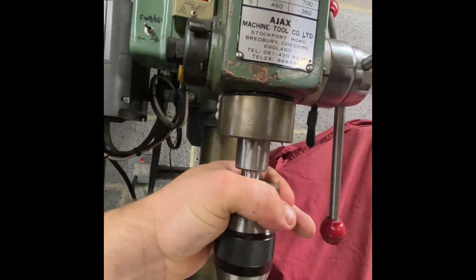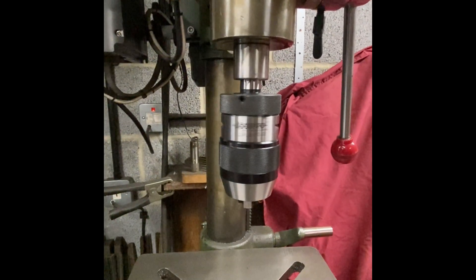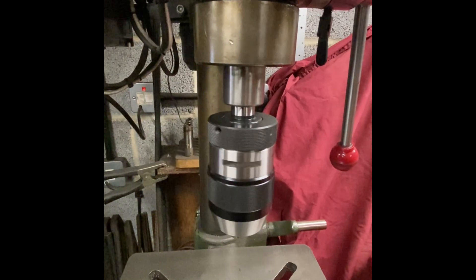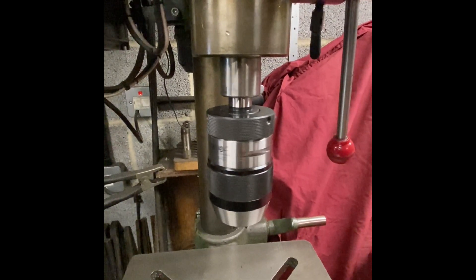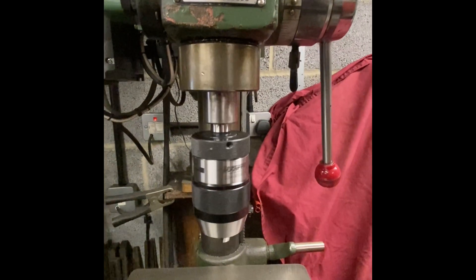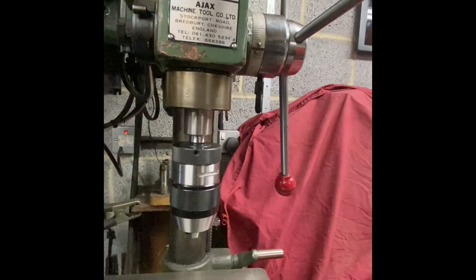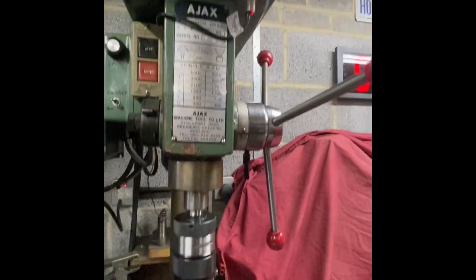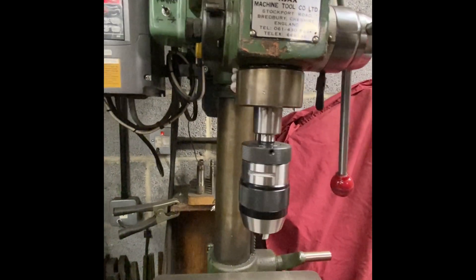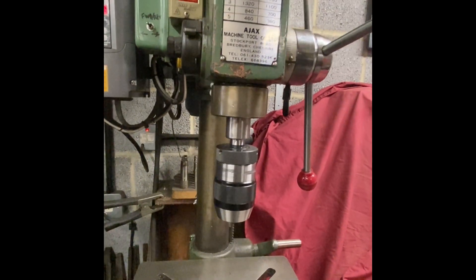One of the beautiful things about variable frequency drives is when you get down to the very lowest speeds, the torque drops off. So if that were a geared drive, you would have massive torque available and could possibly hurt yourself because the spindle wouldn't stop if it locked up. Whereas in this case, because the power drops off on the motor, if I try really hard I can actually stall that. But as soon as you go up a speed to around 82 rpm, the power is such that you can't stop it. So one of the things you need to think about if you're designing your own variable speed conversion for a pillar drill is the lowest speed you want and the torque availability.